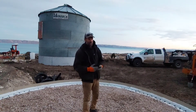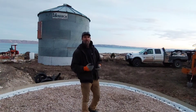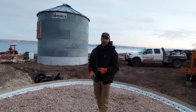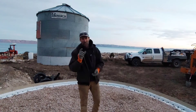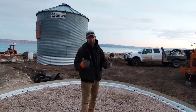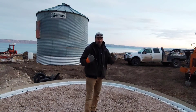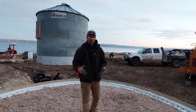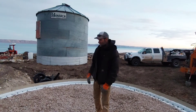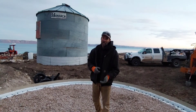So I found a different product that takes the place of rebar. It's more expensive than rebar, but it's going to save me a day's worth of labor. It's called Helix — I'll put a link in the description to their website. It's little metal coils. I'll pull one out tomorrow when we pour and show you what it looks like. The way it works is you take your rebar mat that you have engineered for the pour — foundations, footings, flat work — take your rebar grid and calculate a dosage. They sell it by the pound.